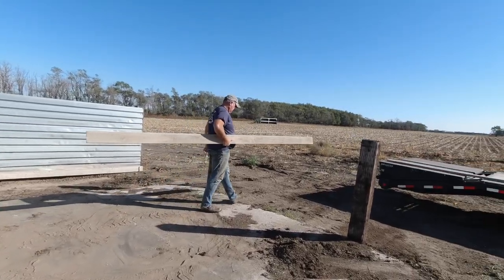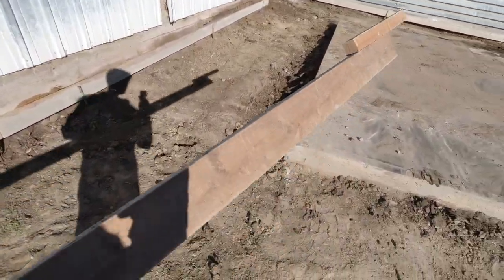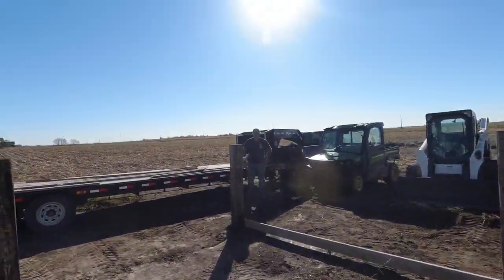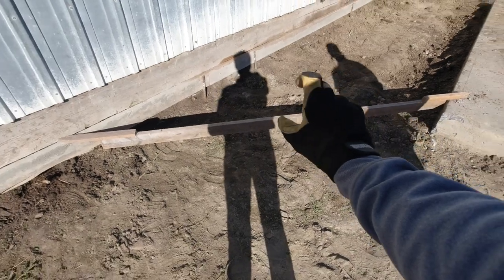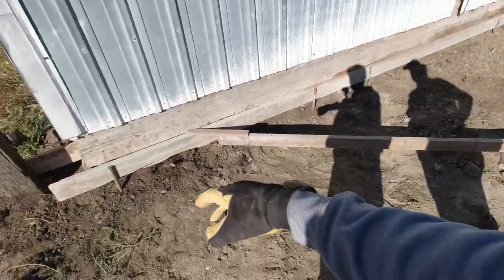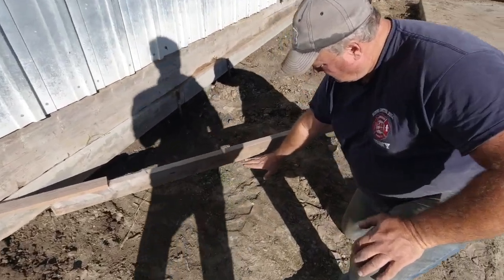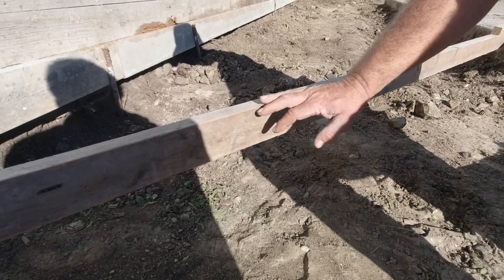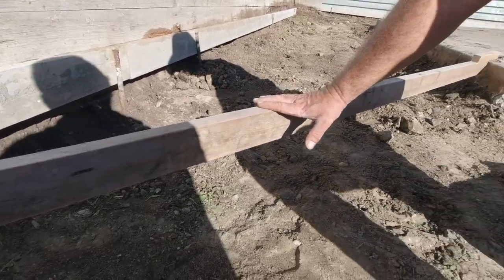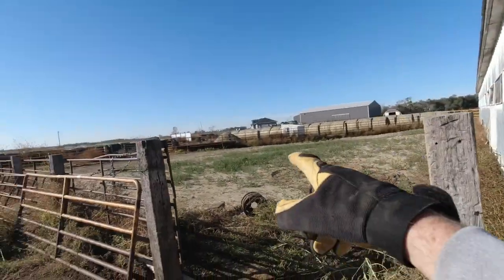That was the hard part. So for that frame we got a 6-inch board, and this is what we call a screed. The screed is a 2x4, which is actually 3 and a half inches. You lay some gravel in there and you run that through — you got kind of a lid on it — run that through and pull the extra gravel out. So our gravel goes to here, and this is the thickness of our concrete, the 3 and a half inches. Some people would say that's not thick enough, but we're not driving on this, it's just for cattle — it'll be fine.